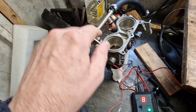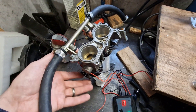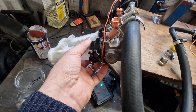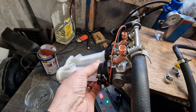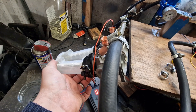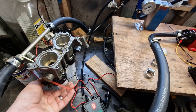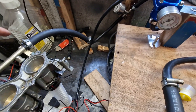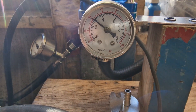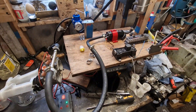We come out of the fuel pump down this pipe to the fuel rail, which is the CBR's original rail just cut in half, because I can't use that as it is anyway. I'm using the CBR injectors because I haven't done the proper sizing yet, but it'll all flow through as needed. I've got a device that will alter the amount of pulses - low, medium, and high - and then from that we go out to the fuel pressure regulator, set to 40 psi, then back to the tank, cycling around.